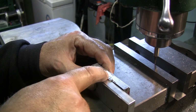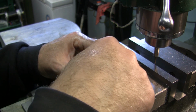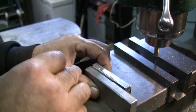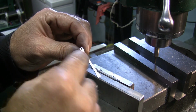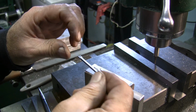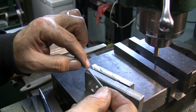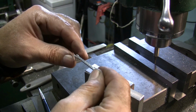And I can go in and adjust down my 15 thou, cut one side, and that's why I made the little undercut on the end here. Once I cut one side, this pad is thicker than here, so when I flip it over, that thick part will fit down into that little pocket on the end. I hope you follow along anyway.